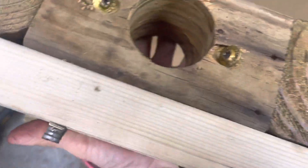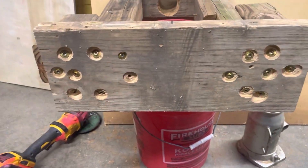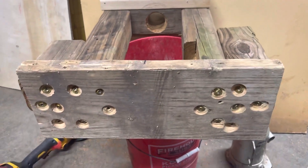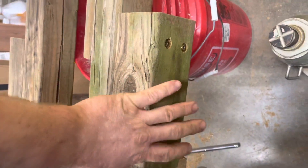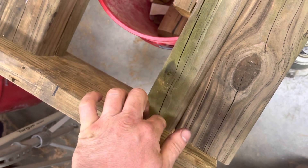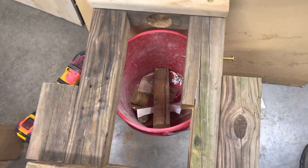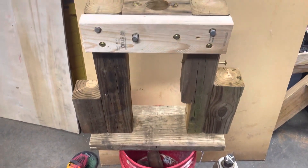I've got a lot of these nearly six-inch screws holding this together, and you need at least this many. Old wood may need more than new wood would. It was pulling apart until I put all the rest of these screws in, so it's putting out a lot of force. I added extra screws to give it a little more before I'd rip off the base. Whenever you stick screws into end grain they don't hold very well, so you need a lot of them. I've got these screws going across the grain at a bit of an angle so they're not just driven straight into the end grain. You can also use a much smaller jack — a lot of hydraulic presses in stores are typically only six to ten tons.